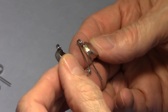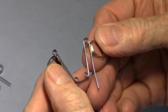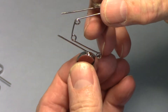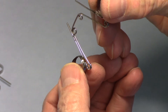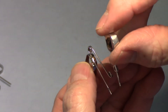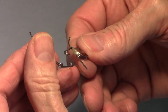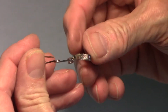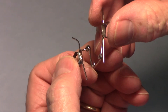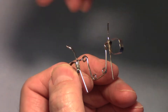Here's the first appliance we soldered — the quad helix. On this one I just added the solder without using a probe and let capillary action draw it into the solder area. Here it is polished: on this side you can see it's covered pretty well. On the other side it could have been sweated a little better — had I used the probe I could have gotten it a little better — but that's adequate. It's covered up nicely and it's not a porous joint. Then we used the probe on the second one to move the solder around; we got a real good sweating, and it polished up very nicely. Everything's covered, there's no porosity, the ends of the wires are tapered and completely encased.